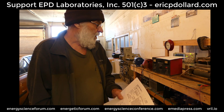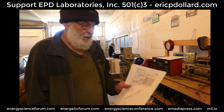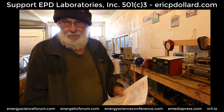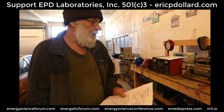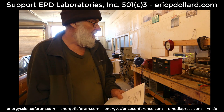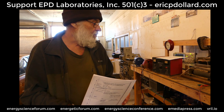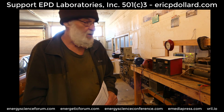Our objective was to produce a source of electric power by parametric variation rather than standard induction. Capacitance varying with respect to time produces basically an admittance — but a negative admittance — so rather than consuming power, it produces power. The whole question was what's the relationship between the power it takes to drive it and the power that comes out, because there was a possibility it could have been more than 100%. He built this machine in order to start testing that.